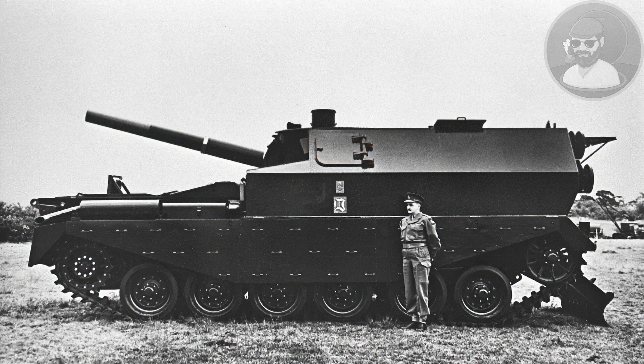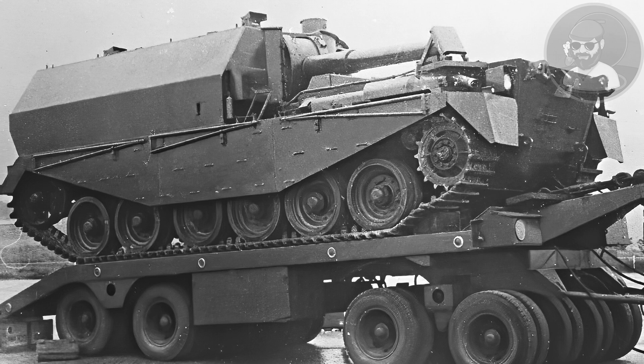The gun itself was a 5.5 inch breech-loading quick-firing piece which had seen service throughout the Second World War as a static piece and at 6.1 tons was considered a heavy field gun, able to fire a 100-pound shot to about 14 kilometres. The gun was mounted in an A-frame inside a semi-spherical rotating platform inside the casemate, giving good traverse arcs. It was also considered the vehicle might have to directly engage armour in a pinch, so a 5.5 inch HESH round was added to the vehicle's capability. Each vehicle would carry 35 high explosive regular or supercharged rounds and five high explosive HESH rounds.